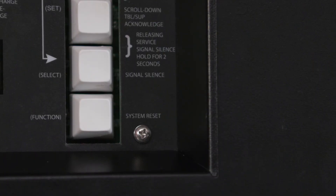Next, reset the automatic actuation system. What do you mean by automatic actuation system? It's simply the detection system that's activating the deluge valve. Could you give us some examples? Sure, smoke and heat detectors are commonly used ones. For electronic actuation, reset the electronic detection system in accordance with the manufacturer's instructions to de-energize the solenoid valve.